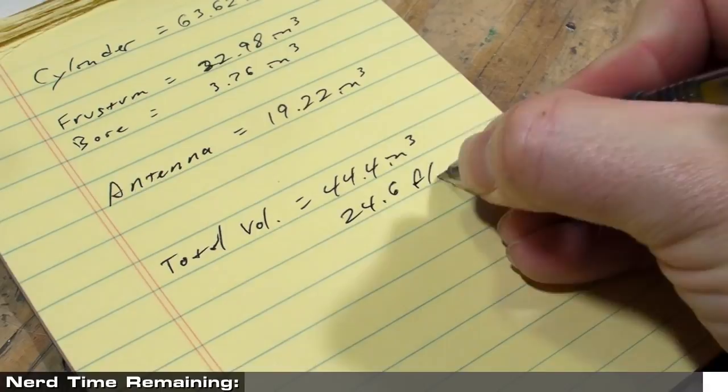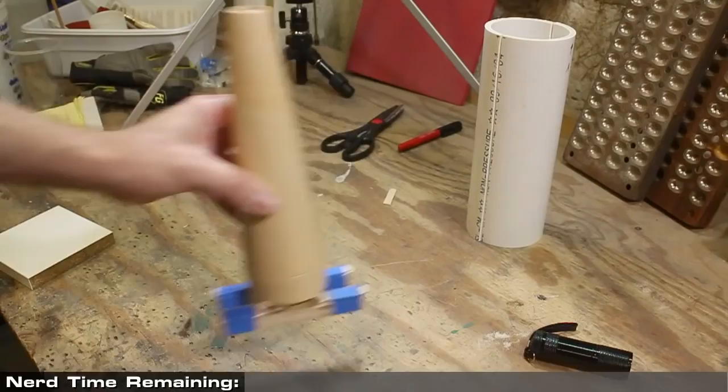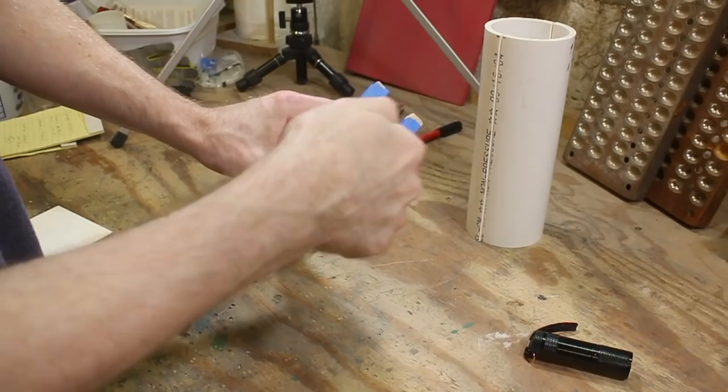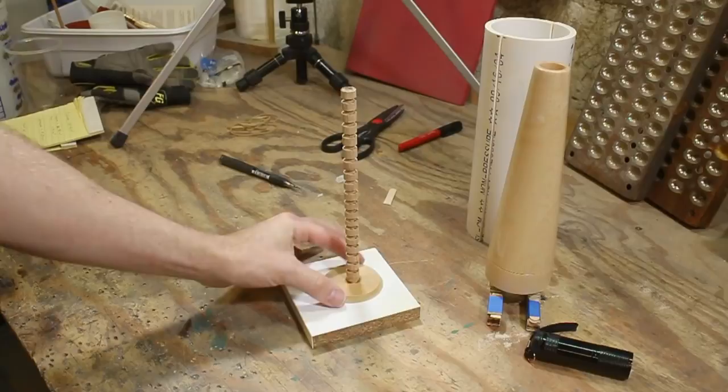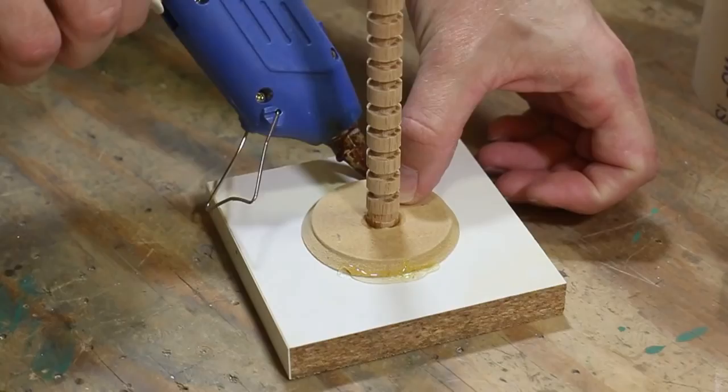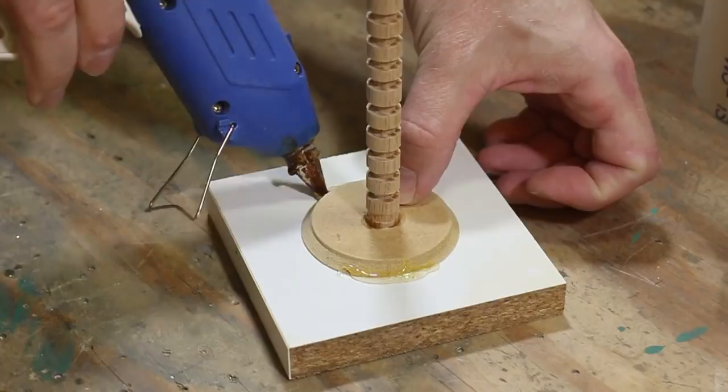We'll call it 25. So once I pour the mold and pull out the master, we're going to end up with a column of silicone sticking up through the middle. Being silicone, that's not going to be very rigid. So I made this earlier, and this is going to stick up through the middle and become part of the mold. The ridges are so the silicone doesn't stretch and slide up it while I'm pulling out the casts.